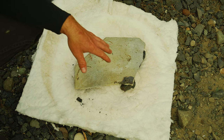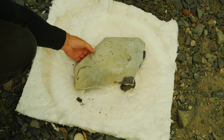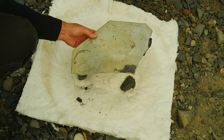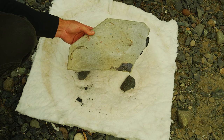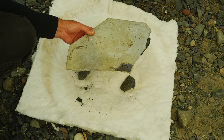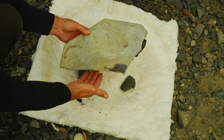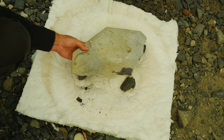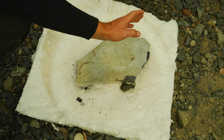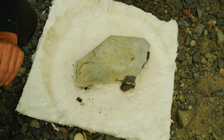This is one of the first things I would change. In an ideal kiln, you would want the flames coming underneath the kiln shelf so that the flame is not direct onto the pottery. The kiln design I have here is quite low — only about 11 inches of space from top to bottom — so there's not a lot of room to elevate the kiln shelf, place the burner below it, and still have room for pieces on top. As a result, there's always at least one piece with direct flame on one side, and that kind of ruins the glaze on that side.